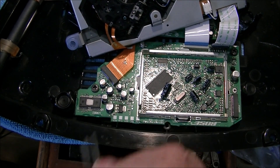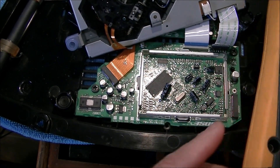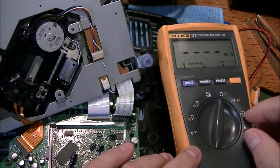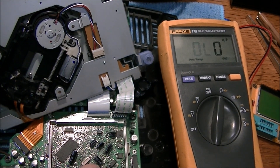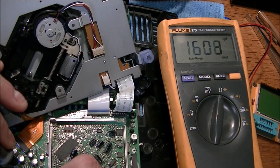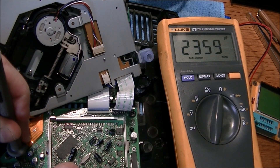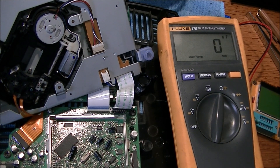I'm going to try to save the cap so I can test it. I want to show you the reading I'm getting on the capacitor I'm debating on pulling out. We'll turn it back on, go to capacitor reading - and here we go. Two thousand three hundred sixty-one microfarads - that's supposed to be a 47uF cap. I'm definitely replacing that one.